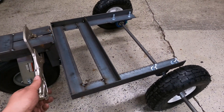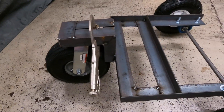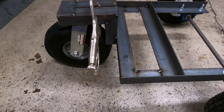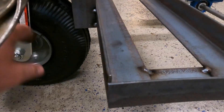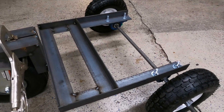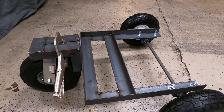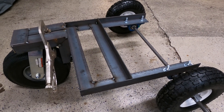We're on to what I'd call the second or third step. I showed you the frame — just those four pieces of 18-inch angle iron, the pillow blocks, and the axle. I've made essentially a little gooseneck attachment for my swivel wheel. I had to space it out a little further than I wanted to make sure the swivel clears. It's just clamped in place right now. I think I'll bolt it rather than weld it, just to be safe. I probably need to trim this ear to make sure we've got full range of motion. At this point we need to figure out where the winch is going to sit, how big that sprocket is going to be in the middle, and we need to start thinking about a handle — probably coming off here up to a comfortable standing height. Let's work on the winch mount and go from there.